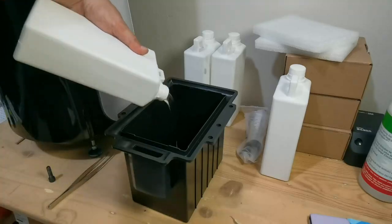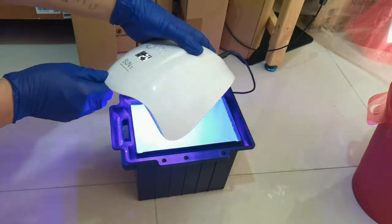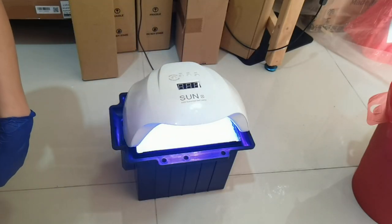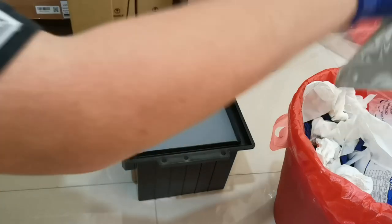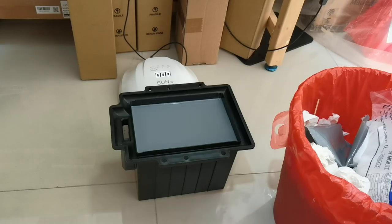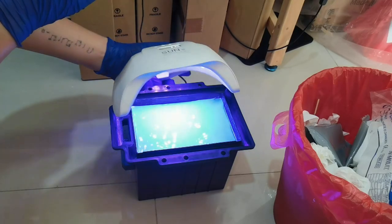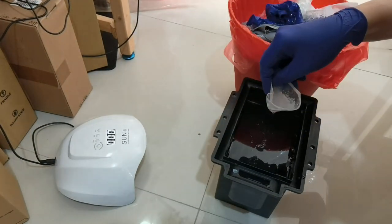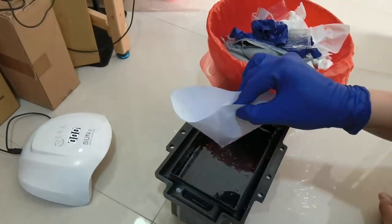You could use filler to reduce the amount of resin needed to fill the tank. But if you use filler, getting the resin out of the tank to switch resins is a difficult process. The black tank they provide blocks UV from all sides, so you can only cure from the top to a maximum of about 0.5 mm thick. You'll have to repeatedly scoop out the goo with a resin filter. So whether to use filler or not — the choice is yours.